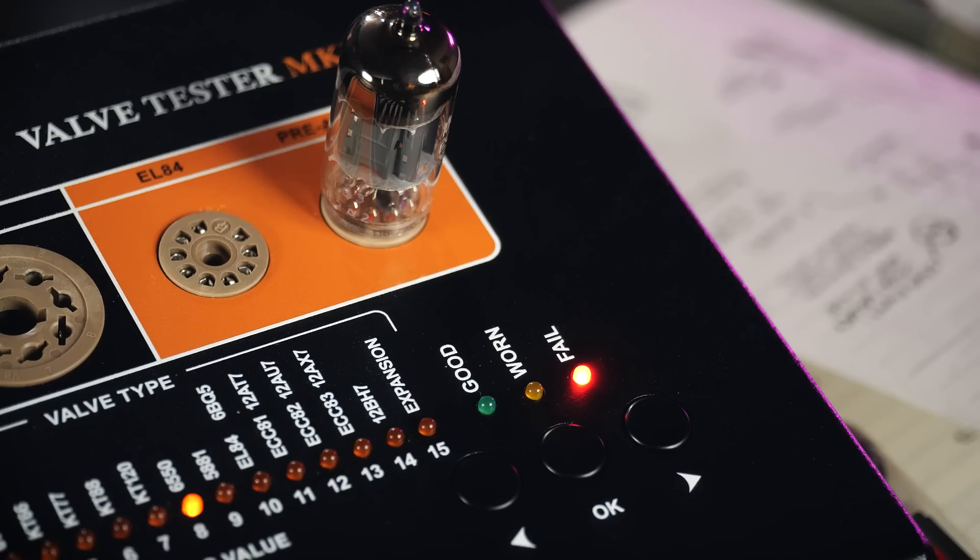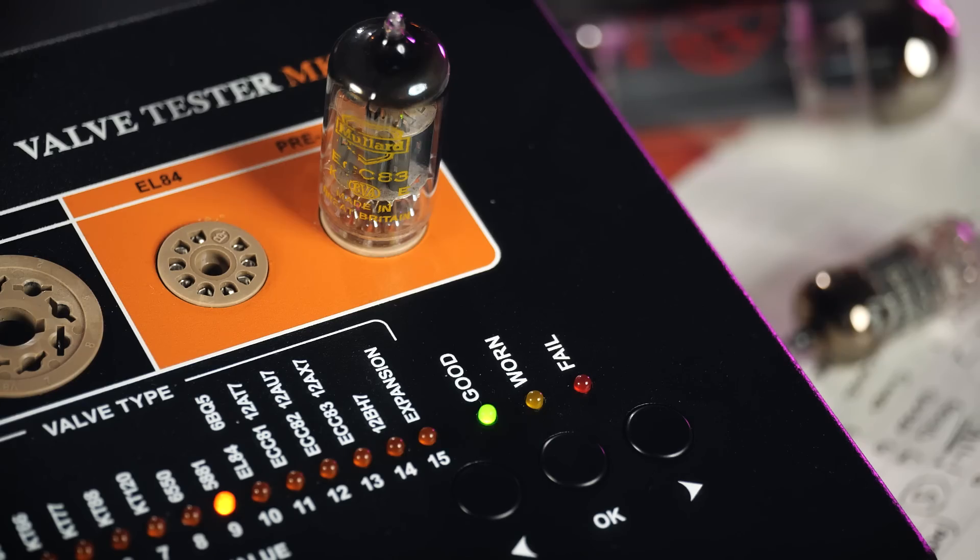I was also dismayed to discover that one of my old Mullard ECC83s failed due to going into thermal runaway — a positive feedback loop where the valve is constantly biasing itself hotter and drawing more current until it overheats, and perhaps even ionizing material inside the vacuum, increasing the conductivity within the tube and reinforcing that heating effect. Thermal runaway is usually more a concern for fixed-bias power valves. It's often stated that preamp valves like these, since they are cathode-biased which affords them permanent negative feedback, can't go into thermal runaway during normal operation. So maybe this failure won't show itself in use — I could throw this into a sacrificial device and see how it performs. Or maybe this old valve is indeed faulty and I need to accept it and let it go. Its counterpart, however, passed the tests without issue, both triode sections having balanced gain ratings.